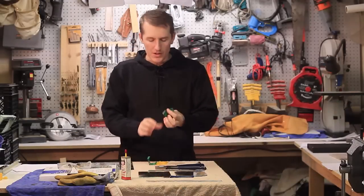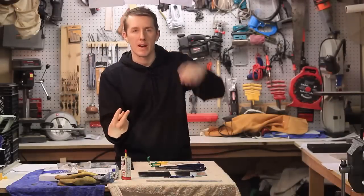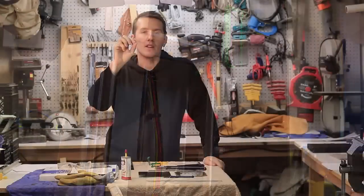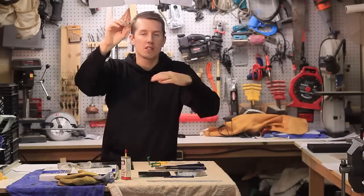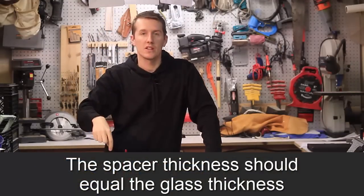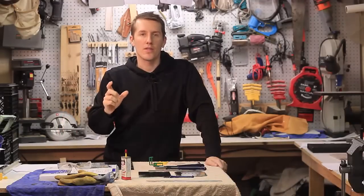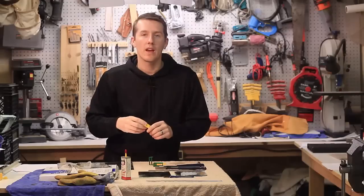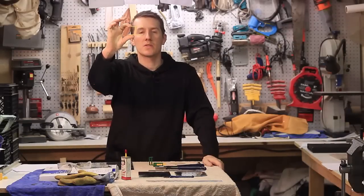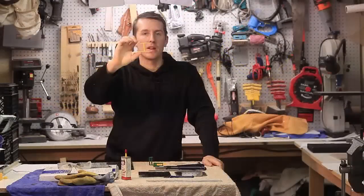There are a couple of spacers people have already drawn. There's one I printed off first — that's this small one. You have to take off the back column of the case; there are three screws on the bottom, three screws on the top. You take it off and snap this in over the black arm. The thickness of it should, in theory, adjust it so it's hitting the switch plate before it's hitting the build plate. Other people have countersunk the build plate, but I didn't want to do that.